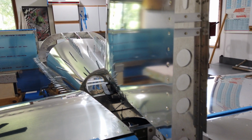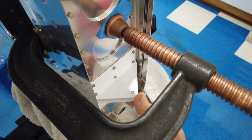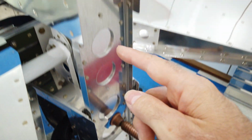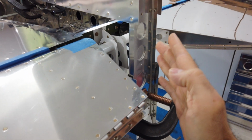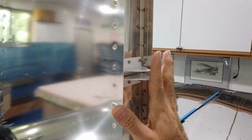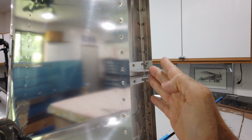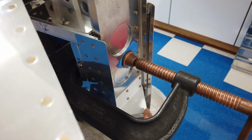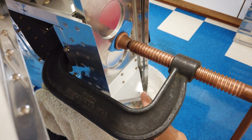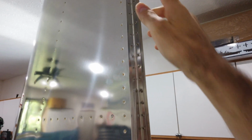So now that I have all of that established, you take a straight edge and you lay it on the tip of your hinges. So you run it from the tip of this bottom hinge on up across this hinge and across the top hinge. Now I use a 4-foot steel ruler. When I lay it across the 3 hinges, it pivots ever so slightly off of the middle hinge. So if I lay it on the top hinge, come down and lay it on the middle hinge, it won't touch the bottom hinge. And I'm talking maybe an eighth, I think less than an eighth. And if I lay it on the bottom hinge and the top hinge, when it comes up to the top, it won't touch. So it pivots here.